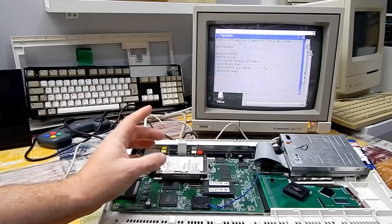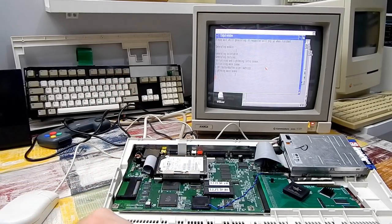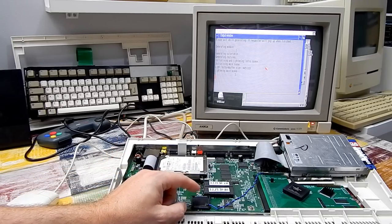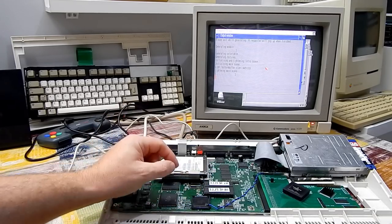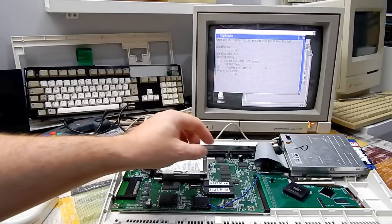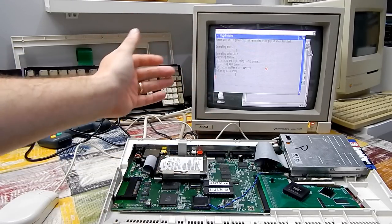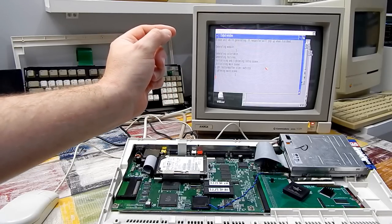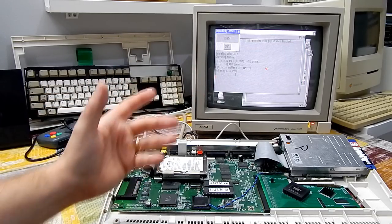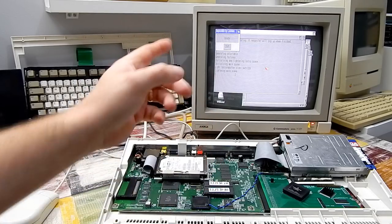I would still like to try and understand though why this FPU result under SysInfo, with the now 54 megahertz clock coming into it, is less than what we've seen with the 28 megahertz clock coming off the CPU? So if anyone has any ideas about that, please let me know. It's currently processing what it needs to for that other FPU-required demo, Impossible, rather accurately named because it's almost impossible for this machine to run it.